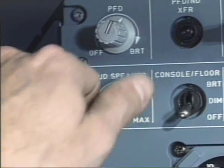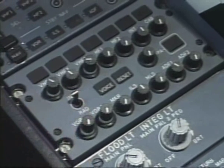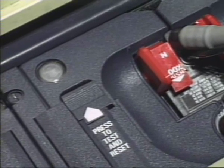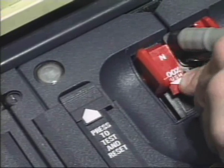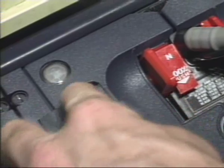The microphone is tested by activating the loudspeakers and the interphone, and by pressing the emergency rotation knob. When the previous tests are completed, make sure that the normal 100% selector is locked in the 100% position, and the reset test slider returns to the up position.